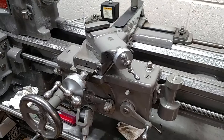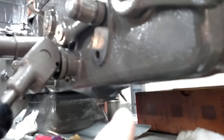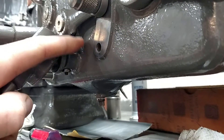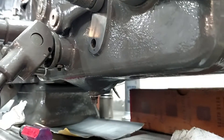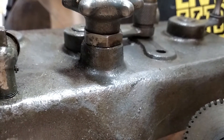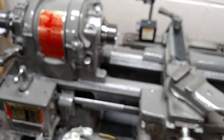I was scared that the bolts up here weren't going to line up with this apron, but they did, because I was having some issues with some other spots in this lathe. If you guys remember last time, I was talking about this lever assembly right here and this screw. That screw — they put them on these aprons with these lever-style clutch assemblies. That's a retainer screw. But check out my other one here — my original — and there's no hole there for a screw. That's why I went in a completely different direction and put the whole different apron assembly on there. That one's still good, but I just saved myself a step.